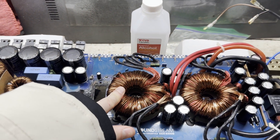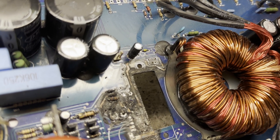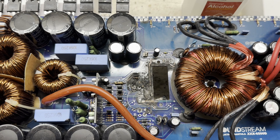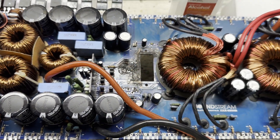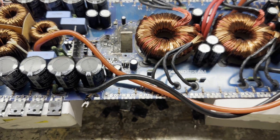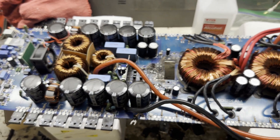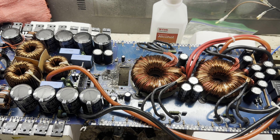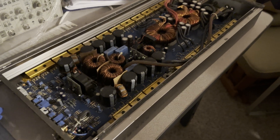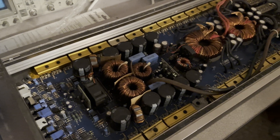Going forward, I probably have to remove this transformer, because the burnt trace goes under it. I'll need to repair that — probably cut out that section, repair each trace individually, and remove and replace the resistors there. I think I will be shelving this for a little while, because this is seeming to be more of a pain than I expected. I have actually managed to find a second amp and bought it. This one came with its little plexiglass panel, but it also has its own problems.